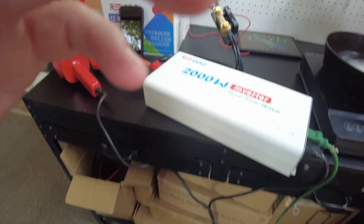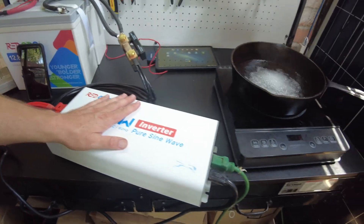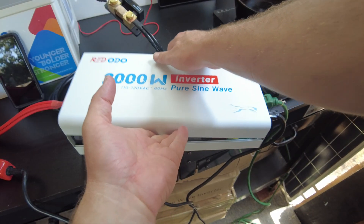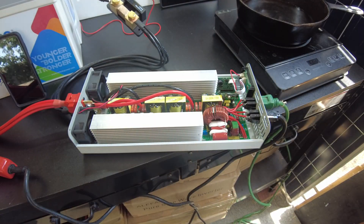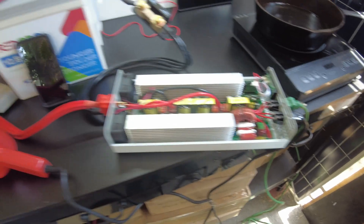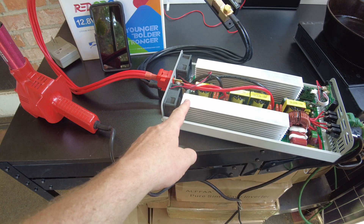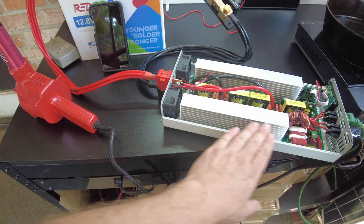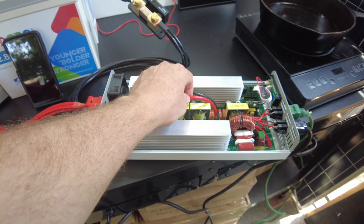Let's turn something down. I think leaving this lid off is going to allow it to overheat, so I just turned it off. The fans are basically just sucking air in and out right at the opening — they're not dragging air across all these heat sinks. But the wires aren't melting.